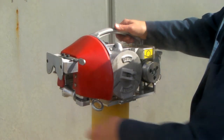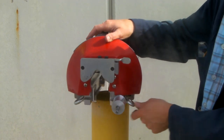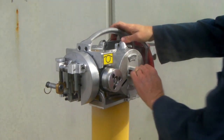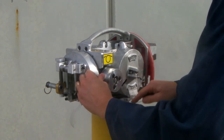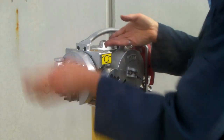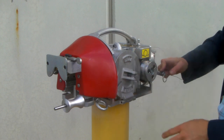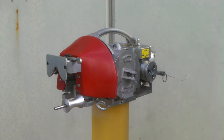You're ready to start lashing with the Eagle lasher. Open the front strand lock with the push button on the lever. Open the front gate — you can lock the machine in position with the front gate open. Open the rear gate and adjust the rollers to more or less where you're going to need them. Get the lashing wire over the drive wheels. The two drive wheels need to be set up independently, starting from the inside out, so that the lashing wire off the back goes from outside to in. Follow the roller onto the drive wheel, from outside to the inside off the back of the machine. You're ready to set it up on the strand.